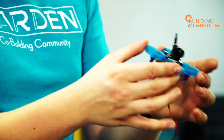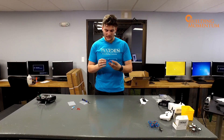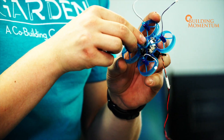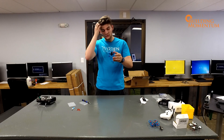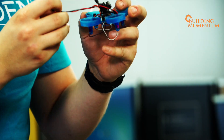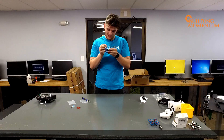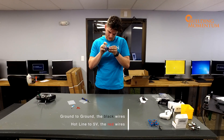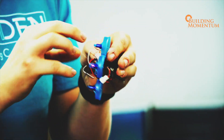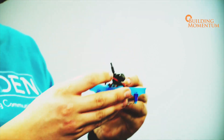Now that we've got everything screwed into place and mounted the way we want, the next thing is plugging everything in. Flip your drone upside down, then plug in the cables for your motors into the closest port. We've got all of those plugged in. Now we need to plug our camera into place — wrap the cord around and make sure that you plug ground into GND and the hotline into the five volts. Everything is wrapped around, assembled and put in place.